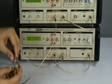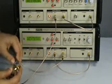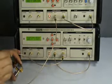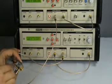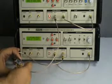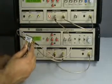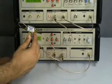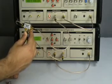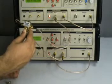Now we will connect the source to the coupler input at 1500 MHz. We have inserted the device in place of the supposedly zero-loss SMA female-female connector. The power level being measured is minus 40.6 dBm, so the insertion loss of this device is only 0.1 dB.